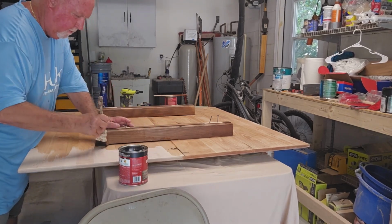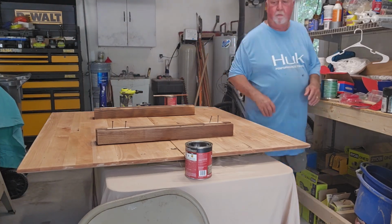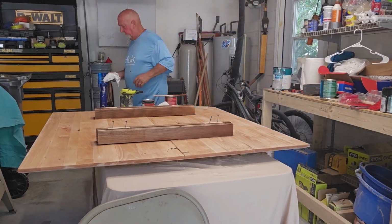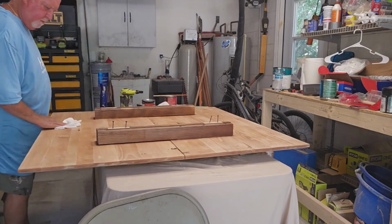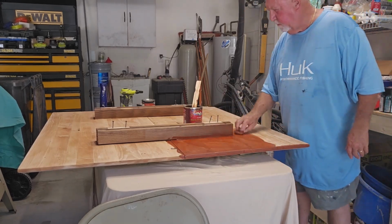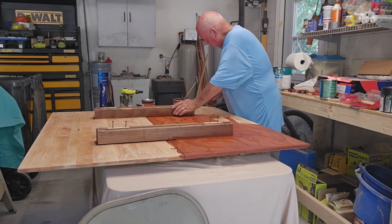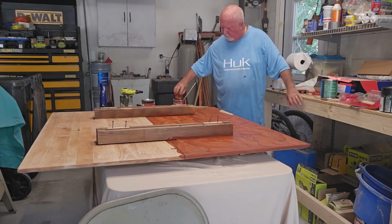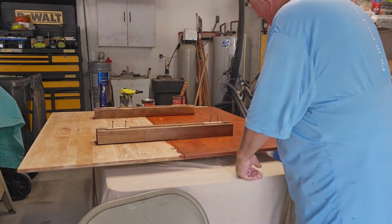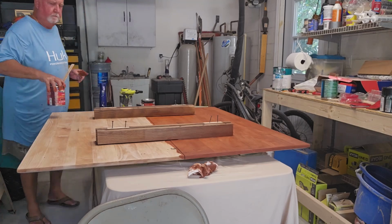Now you notice these two brown pieces that are on the table. These hold the mechanism that lets you put the leaves in when you expand the table. One, I couldn't get them off, and then I decided I'm not really going to stain them or do anything with them, because the stain I'm applying is real close to the stain that was on here. These were not really finished very well anyway, because they're underneath the table and you really can't see them. And there are also 4 black braces attached to the bottom of this table that hide this. There's one brace on each end of the leaf, and it gives a decorative style underneath the table to hide where the leaves attach.